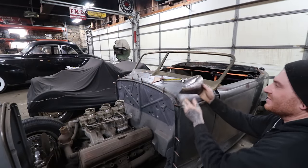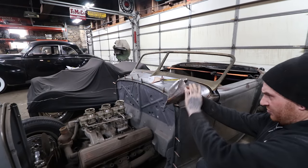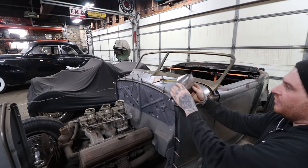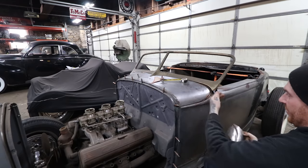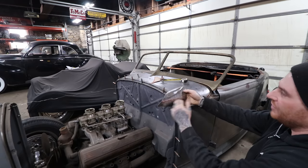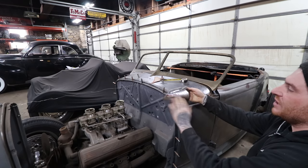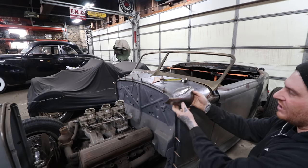So I got this all hammered out on the anvil, and you can see just by stretching the metal, it naturally starts curving around. So it does what we want, but we have this to come around here, and also this to go down. As a reminder, I have a line cut there. We're going to be cutting off a lot of this, but you have to shape all the metal around that area so it naturally doesn't have a hard line when you stop hammering.